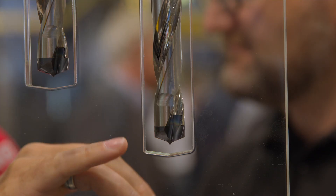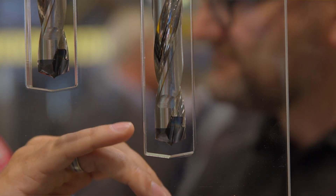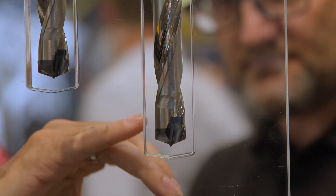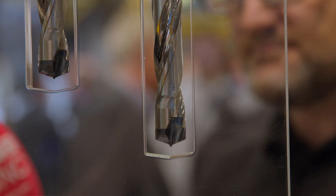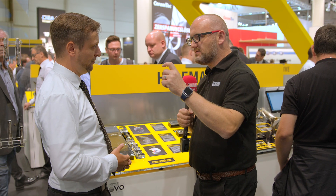So basically it is more protected and much more stable. It cannot be retracted when you pull the drill out of the hole. It's completely covering the clamping mechanism from the chip flow and it's much stronger than the old system. And the idea is it's quite a small insert — you dispose of that and just replace a new one rather than the whole drill.